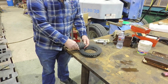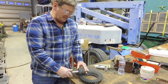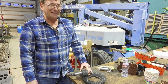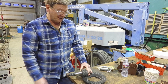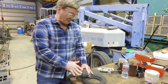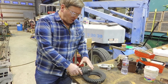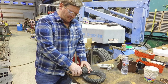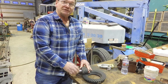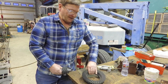Where I really came to understand this was not an artistic exercise but a precise one was with some very large industrial hypoid gears. They were running 400 horsepower input at roughly 1800 RPM with about 20 RPM output — a lot of reduction through a double planetary and hypoid gear set — running continuously night and day. That unit had a cartridge bearing assembly, so the bearings for the pinion were in a complete set and the whole pinion could slide in and out with shims behind it, plus jacking bolts and draw bolts.